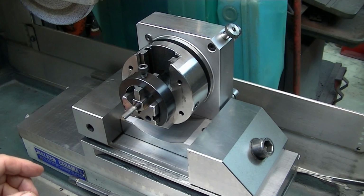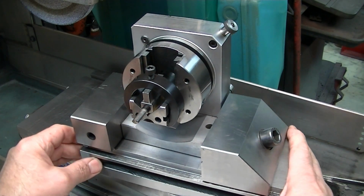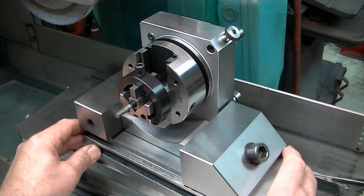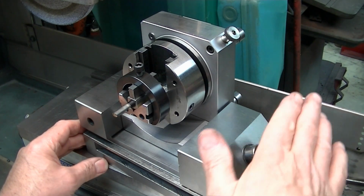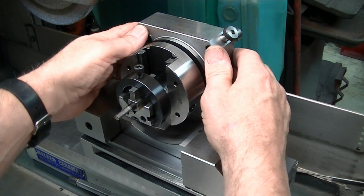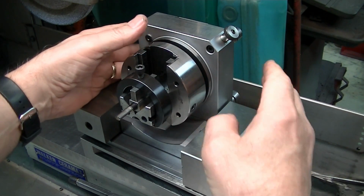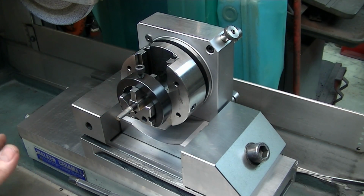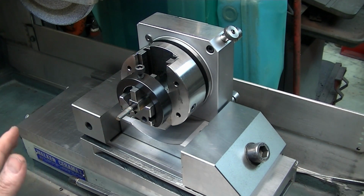Some general concepts here about how I use the surface grinder as a grinder. You think of this as an axis of positioning. And by using an angled block as your reference here, you can slide up against your reference rail and instantly get a known angle either direction. In the same way, this can pivot in the vise like this. So you see me using multiple vises and things like that. It's because it's a very quick way, and with the angle blocks, it's a very fast way to set a position quickly and be able to just dance around here almost quicker than fooling around with a tool and cutter grinder. Nothing wrong with them.